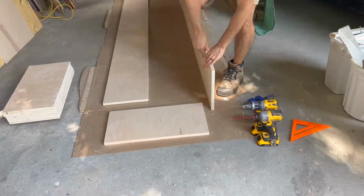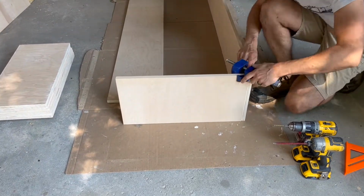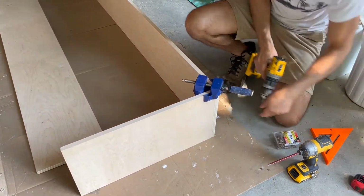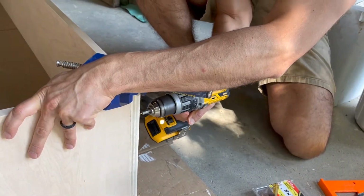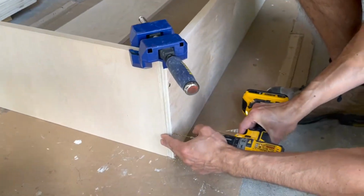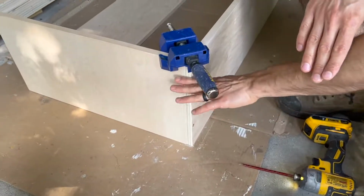Once you've faced all of your edges with veneer, and those would just be the forward-facing edges, no need to do the back edges, you're going to start assembling the pieces. So Stephen is securing the top and the side piece of the cabinet using a right-angled or corner clamp. At this point, it's really important to make sure that the 2 pieces are meeting flush at the 90-degree angle throughout the join before drilling or placing a screw, because if it's not meeting now, as soon as you screw it, that's it. It's going to be really hard to fix.